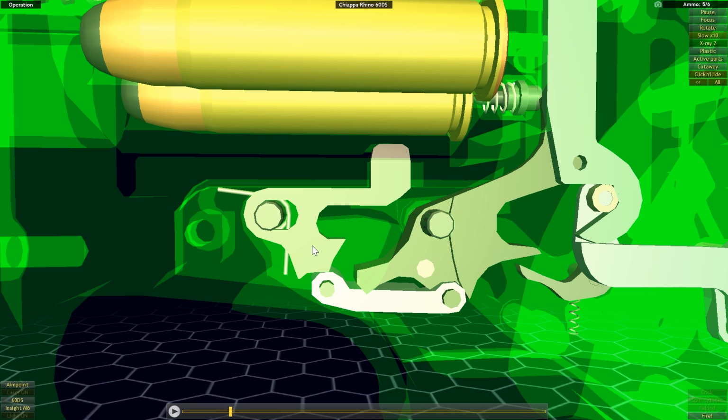If you remember back to all of the examples I've covered in this video series, all of them depended upon one thing to keep the cylinder stop held up into the locking notch, locking the cylinder in place, and that's the tension of a spring. You can test this yourself if you own a swing-out cylinder style revolver. With the cylinder held out of the frame, press your finger on the top of the cylinder stop. You will find that it will push downward under the press of your finger.